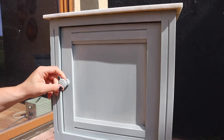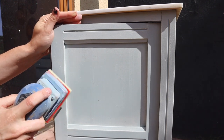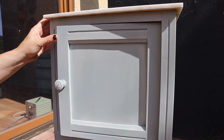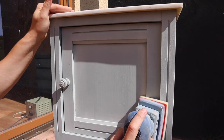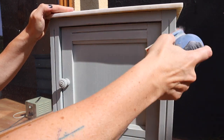I'm going to distress this piece with my three-by-four electric ray by Surf Prep. This is a half-inch super fine pad. What I like to do when I distress is put it in natural places where there's going to be some natural wear and lightly go over it. It does pull away a little bit of the paint down to the wood, but nothing super crazy. This just gives it a worn look.